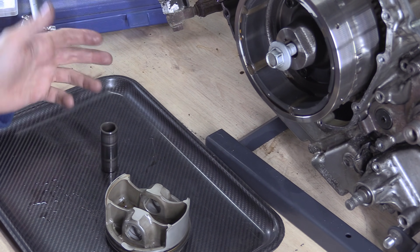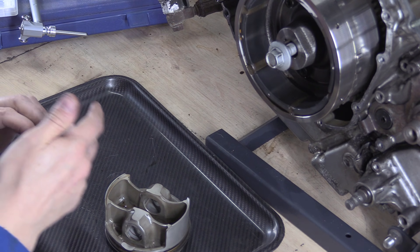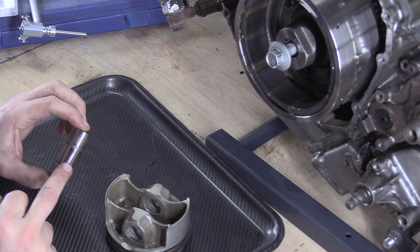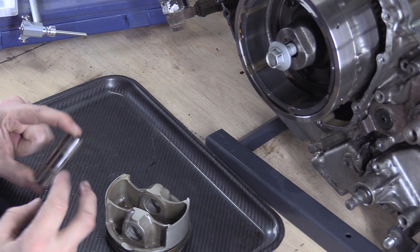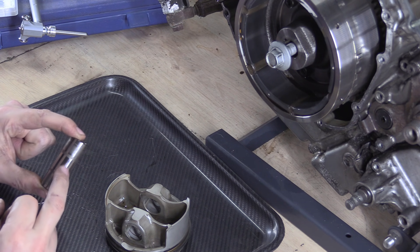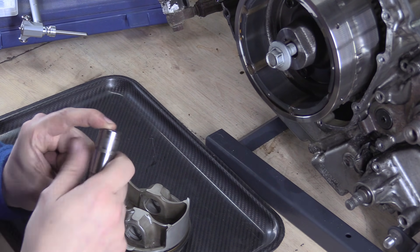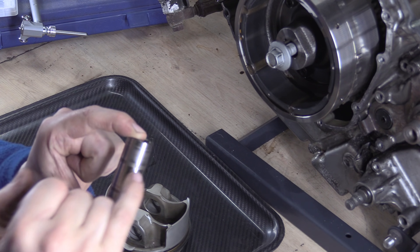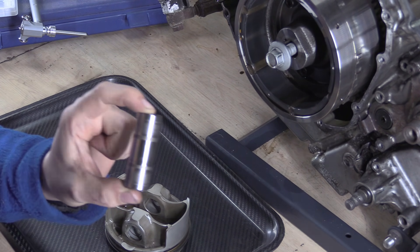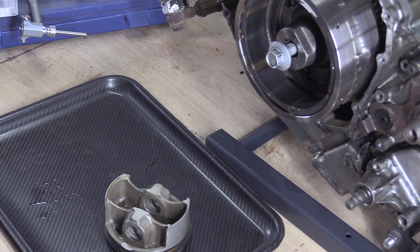It's not imperative — we're not racing Formula One here. It's good to also have three measurement regions on the wrist pin. You've got two positions in the piston and then the middle one which is part of the conrod. You'll see bits in the middle where they're not worn. These marks are where the original coating was — that coating has now gone. That's not the end of the world, I'd never really worry about that.